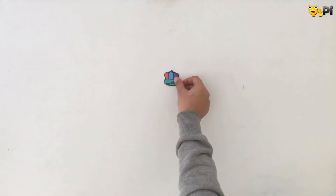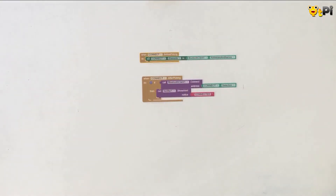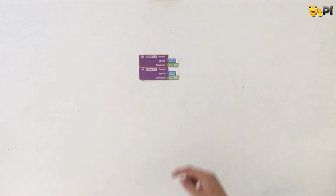To start programming your app, check the backpack on the top right corner of your screen. I am going to drag and drop the Bluetooth connectivity blocks from my backpack — here is my before-picking block and here is my after-picking block. Once I have done this, I am going to program the ultrasonic sensor and the motors. Every time my ultrasonic sensor detects a distance which is lesser than the minimum distance it should maintain from any obstacle, I am going to ask it to take a turn. I am going to program both my motors to rotate in the same direction but change their speeds.